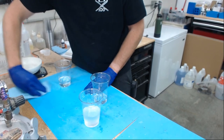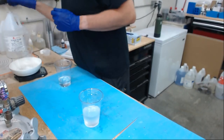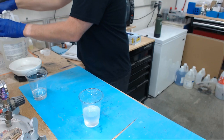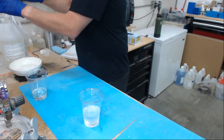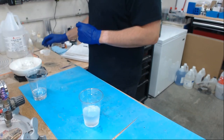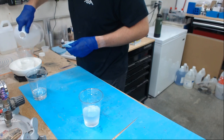I'm getting a new cup and starting fresh. Adding part A — 90 grams — and then zeroing out and adding part B. I've dumped two cups now, which I hadn't done in a long time. Last time was a few weeks ago — dumped a full cup of mixed A and B everywhere and had to clean everything up. Just one of those days. But we got it done, 90 grams each.